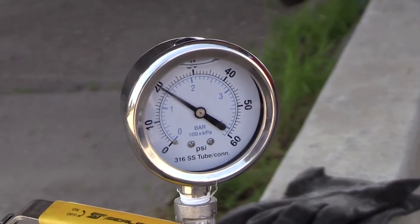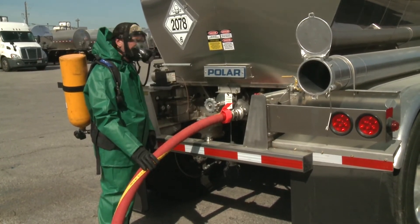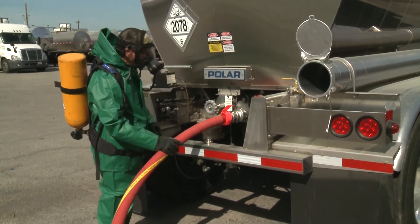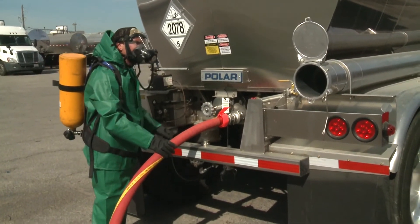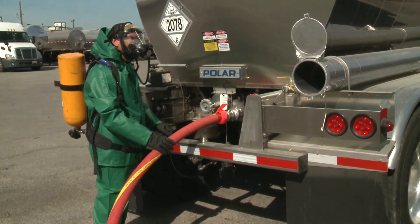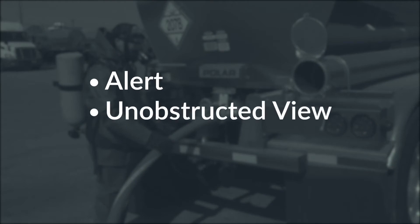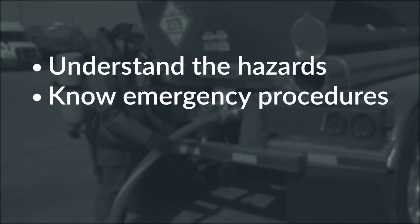Control the nitrogen or dry air pressure to prevent the tank truck's pressure relief valve from opening. Many companies use 25 PSIG as a maximum pressure. During the unloading process, operators stay in the area to monitor the transfer of product. Outside the U.S., different regulations may apply, so different procedures may be required. In the U.S., DOT requires that a qualified person attend the unloading operation. Attend means that the person in attendance is alert, has an unobstructed view of the unloading operation, and stays within 25 feet during the entire process. According to DOT, to be qualified, the person in attendance must understand the potential hazards of TDI.